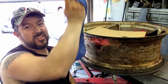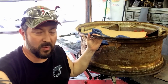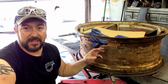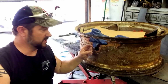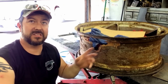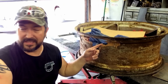But here's the tractor rim. Here's the small hole. It's not really that small. What I'm going to do is, I got some 10 gauge sheet metal, or about 125 thousandths thick, and I'm going to attempt to do this in 3 sections. I'm going to take the plasma cutter and cut out this section where it's really bad and rusty. They used ballast in these wheels of water and calcium something, I can't remember it, but it's really corrosive to steel. So the tube was leaking inside, and through the winter time it ended up eating the rim out.